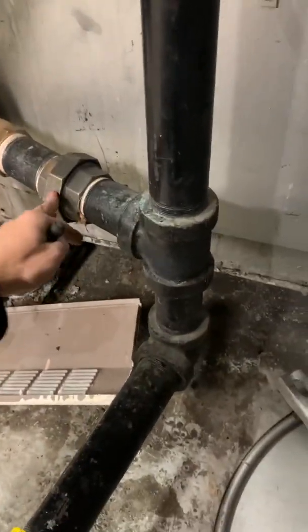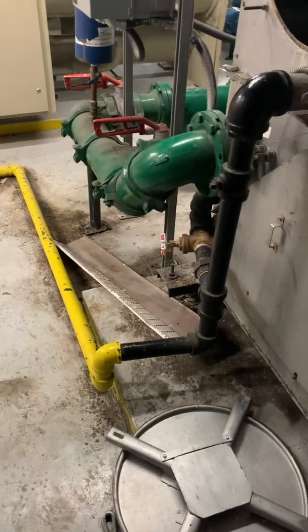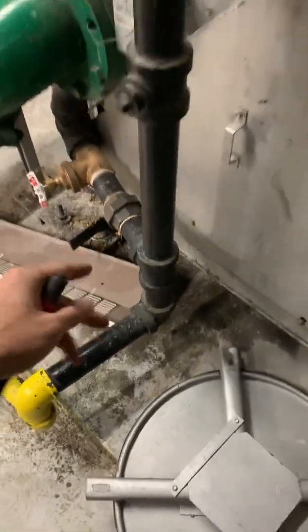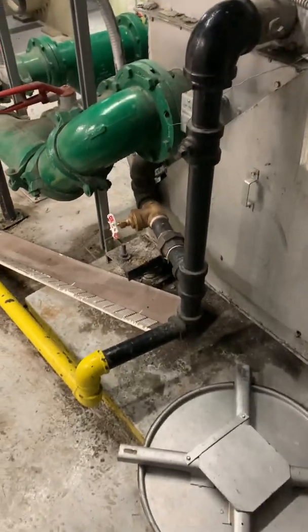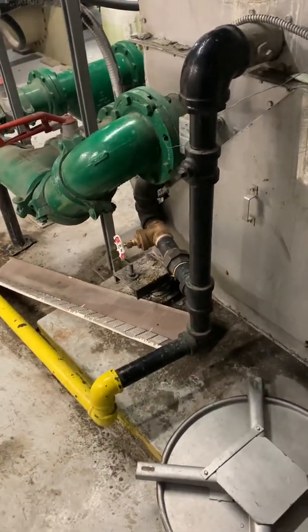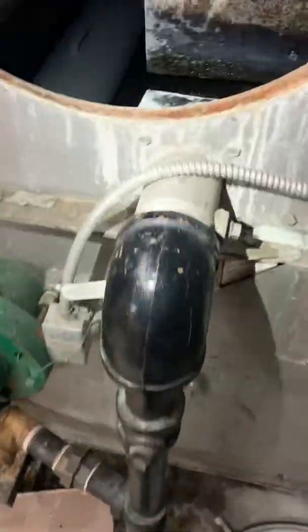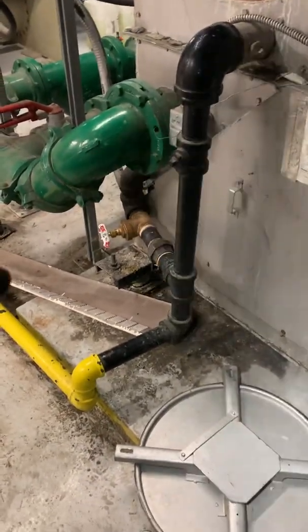How this should be plumbed is you should have a union here and a second union here. So if this issue happens again, you crack both unions and remove the whole drain piece. When you go to put it back with both unions off, you can actually put them on properly. If you crack only one union, you still can't remove the pipe because it can only slide about a quarter inch — it's a solid two-inch line. We're going to quote them to put in a second union and replace the existing one because it's cross-threaded. I also removed the intake filter for the cooling tower, and underneath it was just full — handfuls of scale and dirt. I got enough out that we could actually drain the whole system and got as much out as we could.